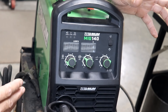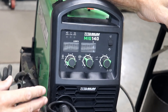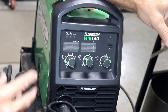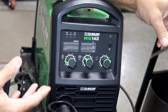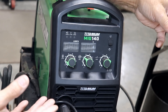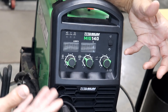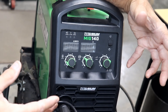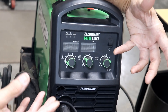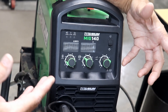One of the myths about flux core welding is that you just get spatter — those little BBs that spatter out and stick to everything. When you set the flux core machine up correctly, you still get some spatter but it doesn't stick and it's very, very tiny. If you don't set it up correctly, you'll get a lot of spatter that sticks to everything. You will get smoke with flux core, which you don't really get with gas MIG welding. The disadvantage of gas MIG is you have to tote a bottle around, pay for the gas, and if it's windy you've got trouble. Flux core doesn't have those limitations.